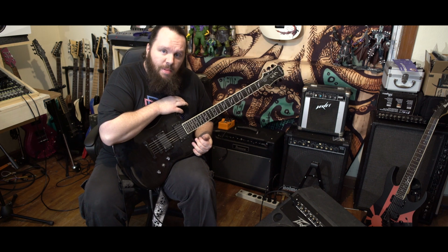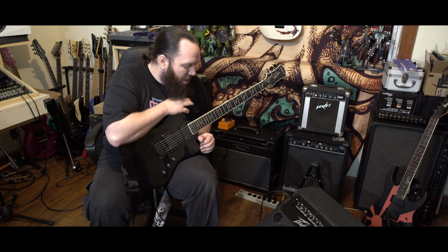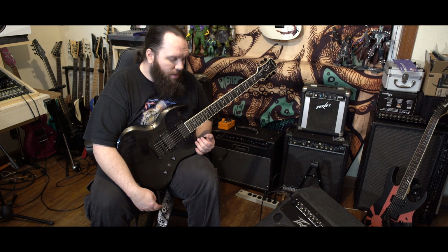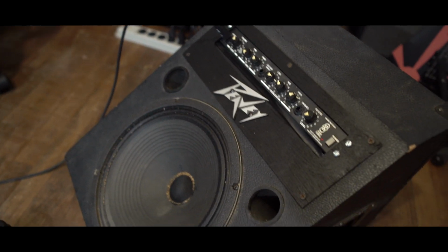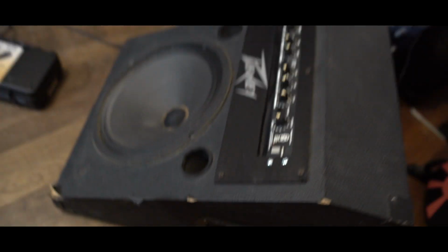What you just heard was a Peavey Blazer converted into a kicked back amplifier, little combo. I'll tell you what, that Celestion makes all the difference in the world. You know, the little tiny 8-inch speaker amps don't normally have the kind of balls this thing has now. I think the ports help keep the low end focused. It's a very interesting sound.